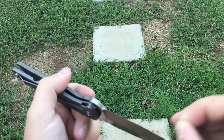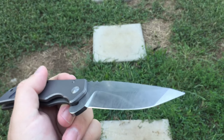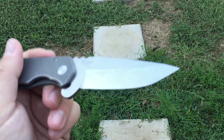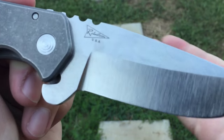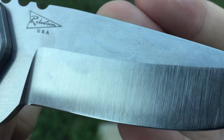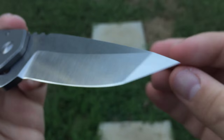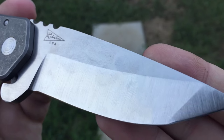PD-1 is a tool steel. It's excellent when it comes to edge retention. It's a decently high carbon chromium steel — it has better wear resistance than D2, but is less stain resistant. So this thing will rust, and you can even see on mine there are some spots. I Flitz them off every so often and try to keep some Aegis knife solution on it. All in all, it doesn't really mar up the appearance at all — it's only noticeable when you get really close. But this is a knife that you're going to want to keep the blade oiled on.